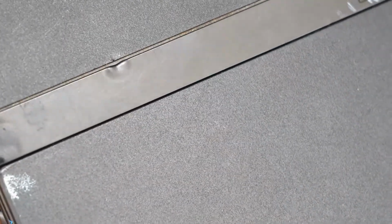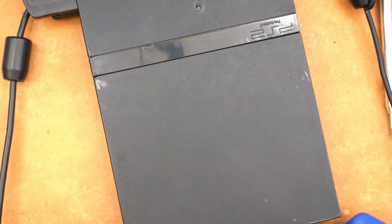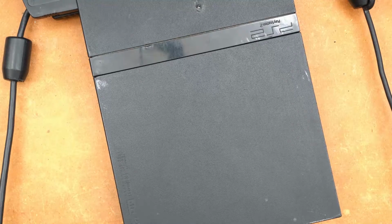So I would say so far in my testing, Samsung cards and PNY cards are a sure bet. SanDisk, I can't say for sure. Maybe other SanDisk cards work, but these ones that use this Micron multi-layered NAND cell do not work reliably in any capacity, from what I can tell. So there may be different models of SanDisk card that would work just fine, but I can't say for sure at this time. But PNY is a sure bet. Samsung seems to be a sure bet.